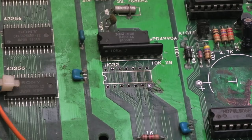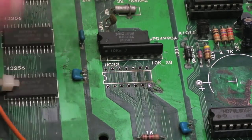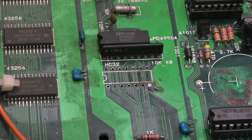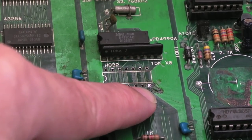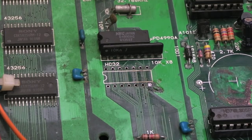The HC32 looks okay - the pins were a bit green - but I thought let's just swap it out anyway. I can't detect any issue without a logic analyzer to capture that pin. This one's been an absolute nightmare to desolder: normal technique - hot air at 450 degrees for five minutes on both sides, then tried the desoldering station at the same time, tried solder braid with flux - nothing will unblock it. It's because the ground rail on that side goes the whole length of the board - it's absolutely crazy, you may as well have stuck a heat sink on there.